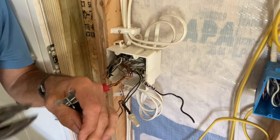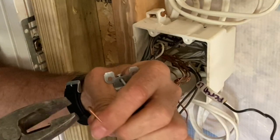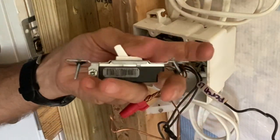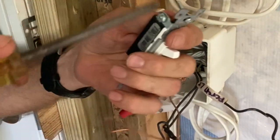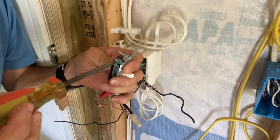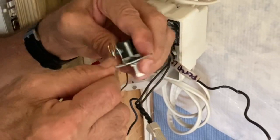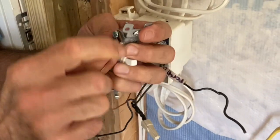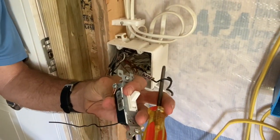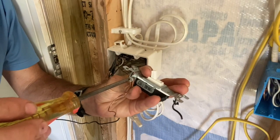The tools you'll need — as electricians we use what I call side cutters. You want to put the wire on with the screw to the right, because as you're tightening the screw it'll tighten the wire up. Another tool you may sometimes need is a needle nose, though I don't need it right this second.